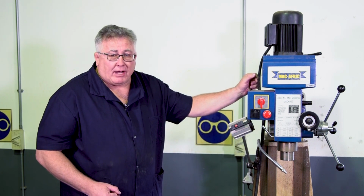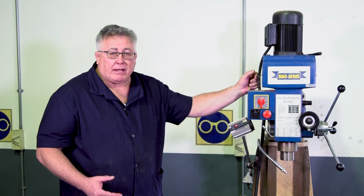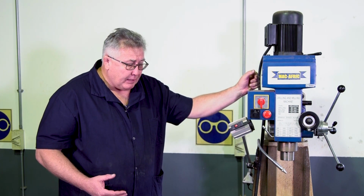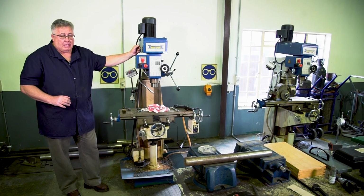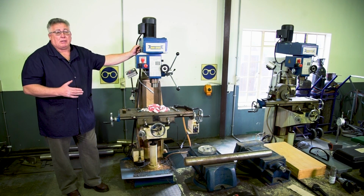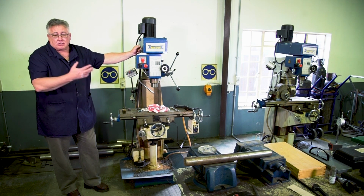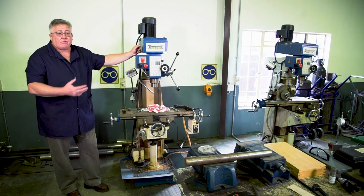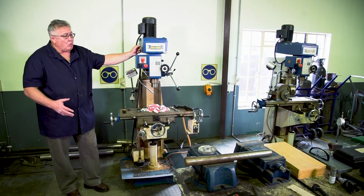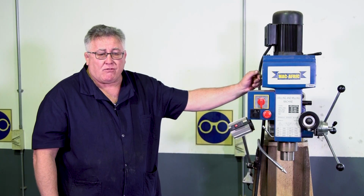but it's normally divided first up into the environmental safety. And what do we mean by environmental safety? It's the safety before you actually get to the machine. And it's not only applicable to a milling machine, it's applicable to any machine that you're going to operate. And the first thing is the floor area around your machine. The floor area must be clear of any obstruction. No oil or water or grease on the floor that might cause you to slip or fall.